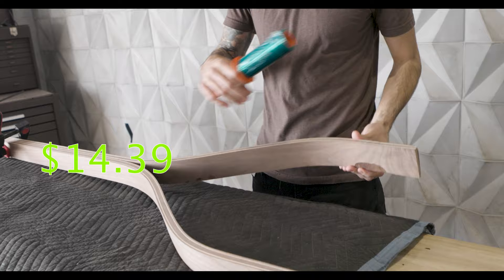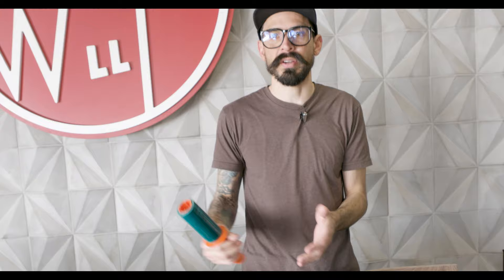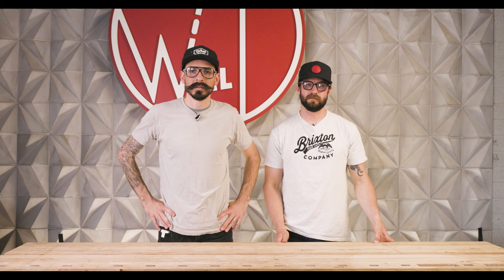Shrink wrap is really important to have in our shop because I do a lot of bent laminations. When I get these tiny little pieces put onto my form, I like to use shrink wrap to wrap them tight and hold them in place while I get the top side of the form on or put it into my vacuum bag. I also use it when I'm batching something out — wrapping small parts together keeps all panels together and everything separate and organized. Very low cost, very helpful.